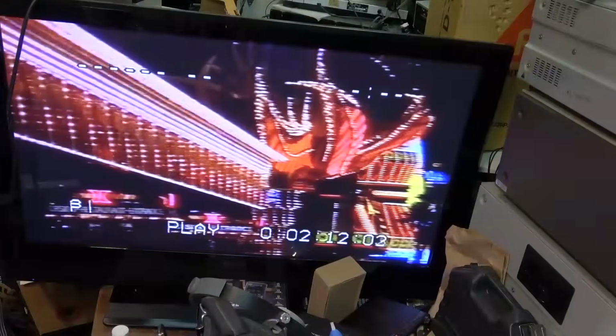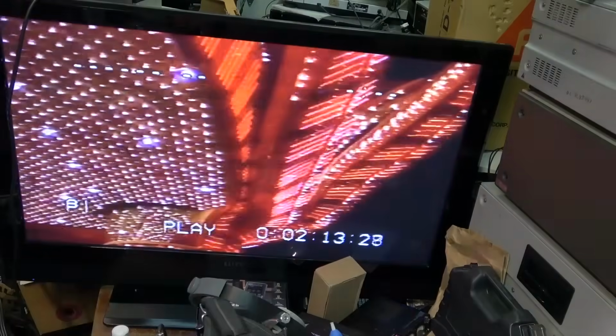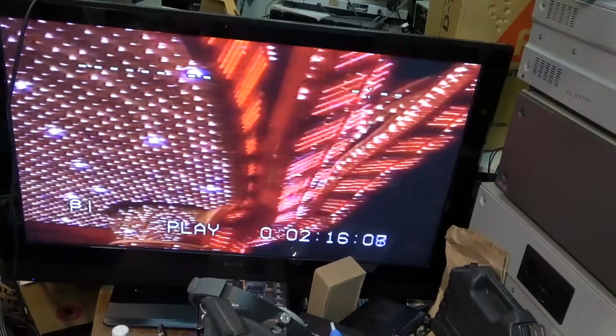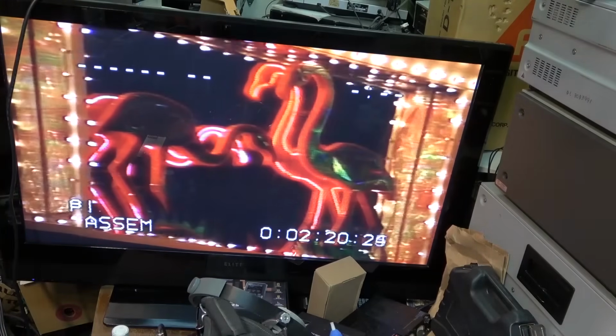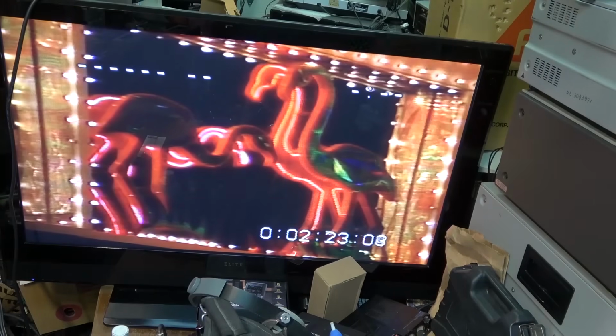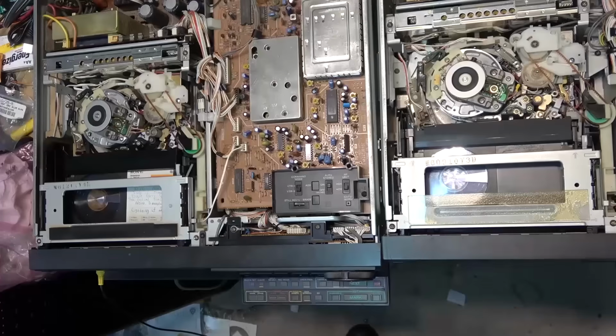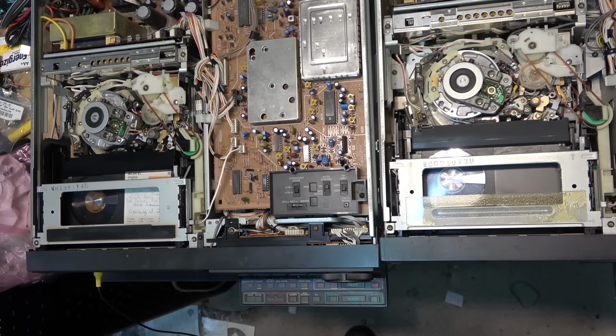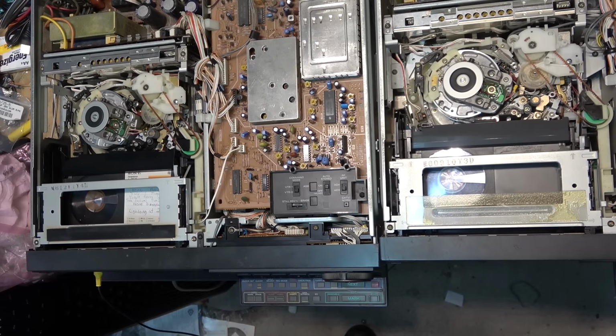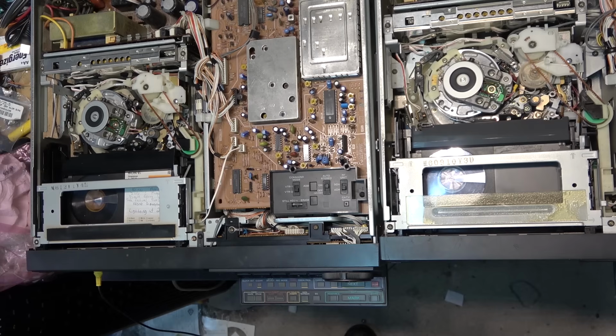So these are what the TV station guys had. And this was the first machine where you could do it at home and do it just like the big boys did. And you needed no extra equipment. All you needed was 2 SL2500s. These machines made editing in the linear tape mode almost enjoyable. You could set up to 8 shots at once and then press the go button or the start button, and the machines would queue up those 8 shots.